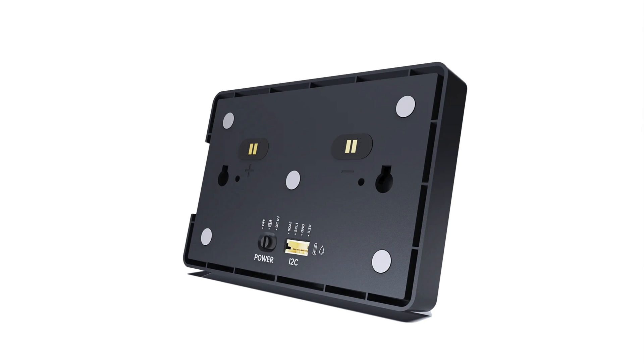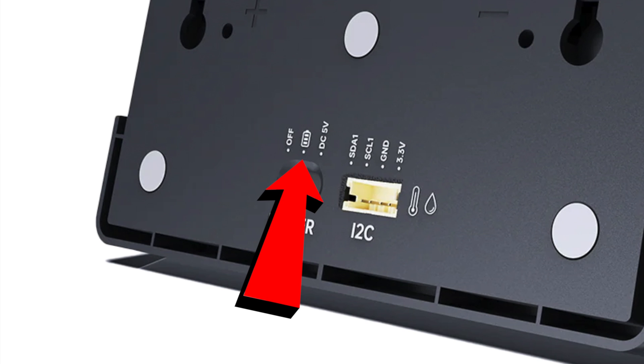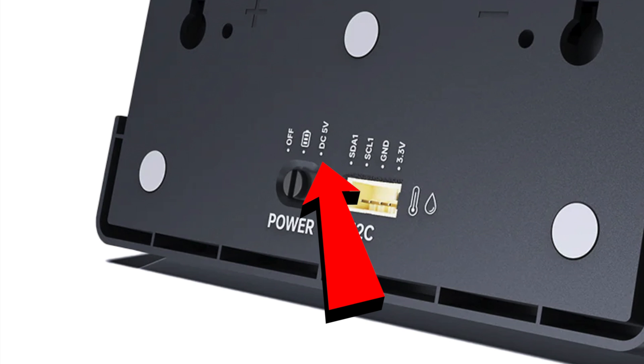There's a power switch on the back of the Panda Touch with three positions. Off — which does exactly what you expect, with the added bonus of charging the built-in battery when docked. Battery — which turns the Panda Touch on and powers it from the battery when off the dock; when docked, the dock powers it and also charges the battery. And DC 5V — which powers the Panda Touch while on the dock, but if you remove it, it instantly loses power and turns off; it also charges the battery when docked. Big Tree Tech recommends the DC 5V position if you turn the printer off when not using it, to help preserve battery charge cycles. If you want to use it undocked, just switch back to battery position. I normally leave the printer on, so the recommended switch position for that use case is battery — and that's what I'm using.